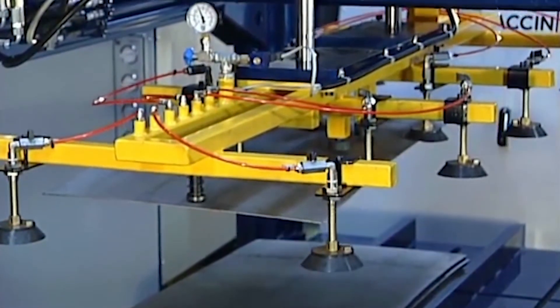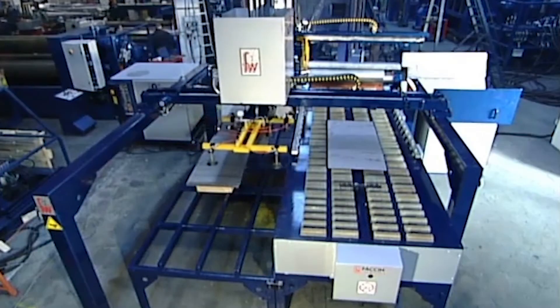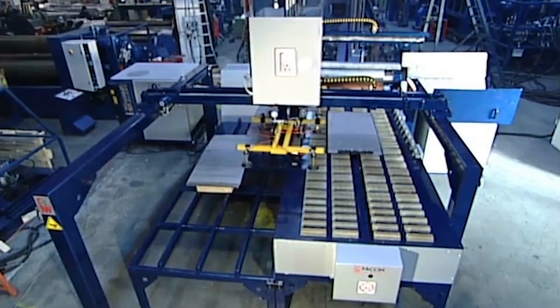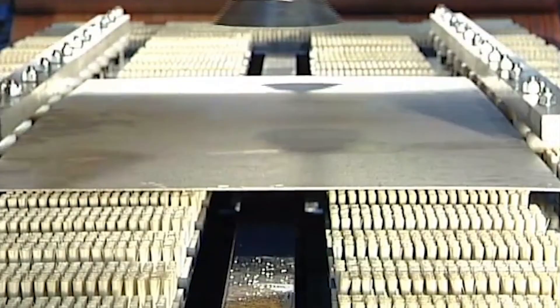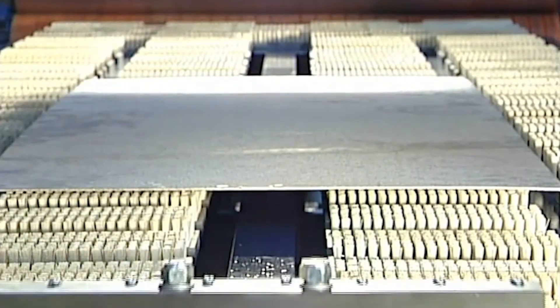At this point, I would like to show you a video of the automatic cycle of an HCU, inclusive of automatic retrieval from a plate stack, loading, bending with spindle pipe, and ejection. Here you can see the vacuum lifting system, and while loading the sheet on the table, the pusher feeds the plate roll. The plate feeding system is complete with scratch-resistant equipment with centering and aligning device.